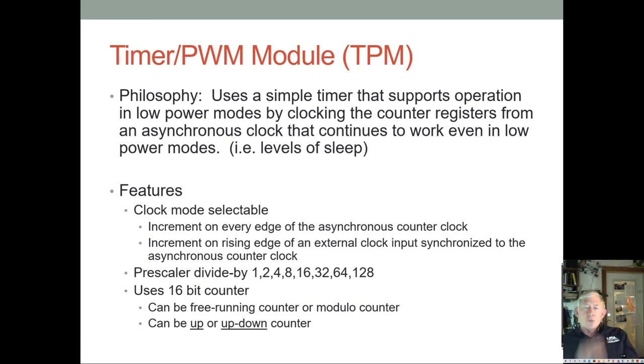And if you look at it on the scope, you have to have a second channel to get it edge aligned correctly, because otherwise it'll still look edge aligned. But if you do it that way with the second channel, you'll see that as you change your pulse width, it's always centered in the window. It's not at one edge. So it's a little tricky. I don't even know how to display it on the scope to make that work.